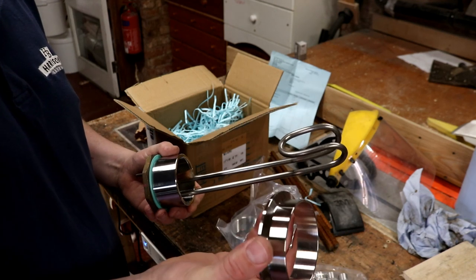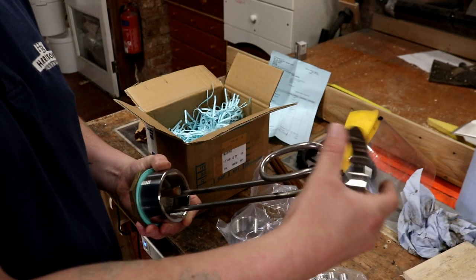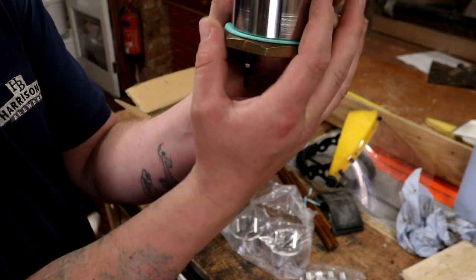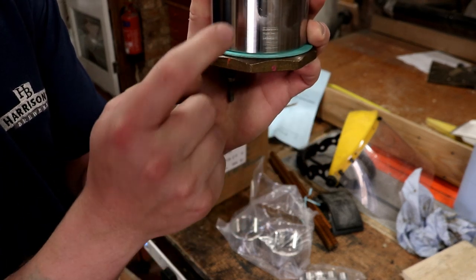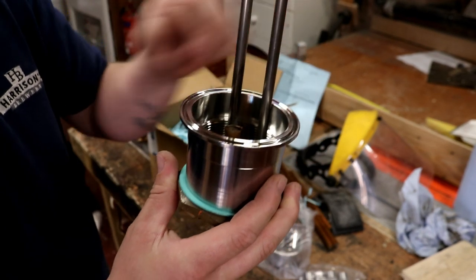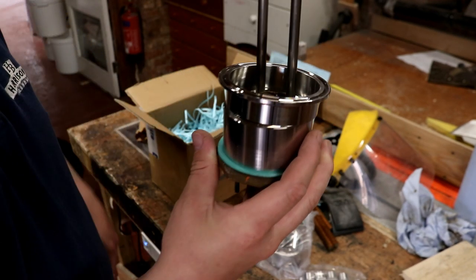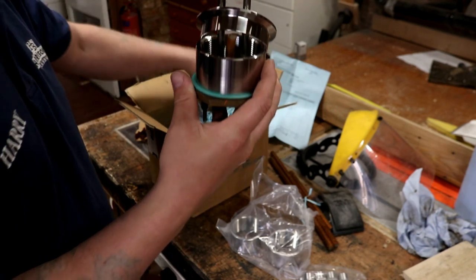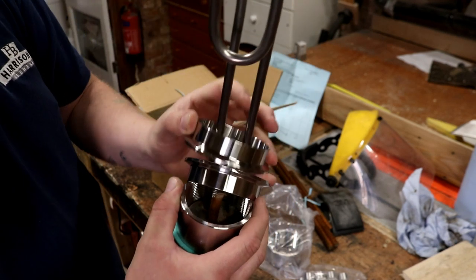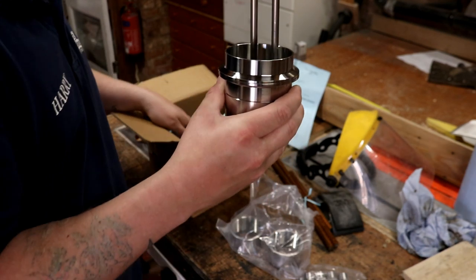And then we have a 3 inch tri-clamp ferrule that goes on there also, and just by coincidence the OD is the same as the 2.25 inch BSP ferrule. So now, once this is welded, we have an element on a tri-clamp. And then of course in here we should have some more tri-clamps. There we go. So that tri-clamp will be on the tank. So we've basically just inserted the element into the tank.